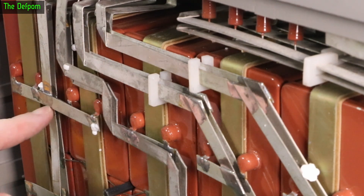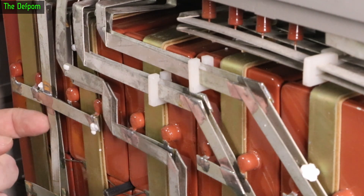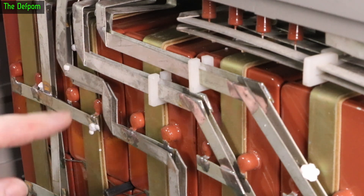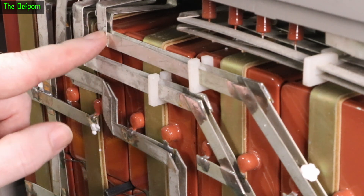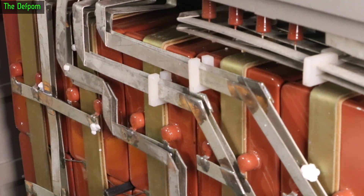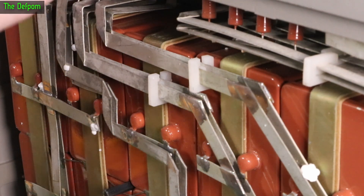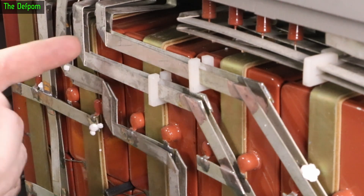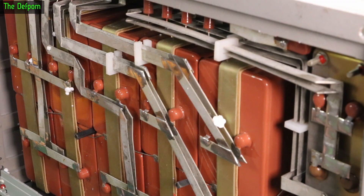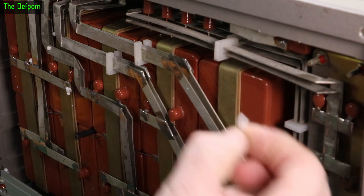These two here are kind of - I don't know - it still feels quite solid but I think that has been bent slightly. It is potentially touching just there. This one seems okay. That one seems okay. But this one is touching. So if I actually bend this back up again, that will fix that problem. And that's what I found before when I was trying to measure it - the 10 wouldn't work, it showed it's a short. And I pulled the cover off and I saw these were touching. I thought right, that's what the problem is.